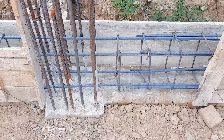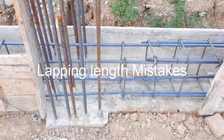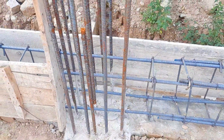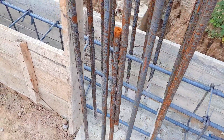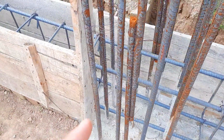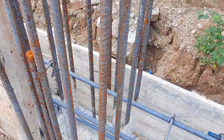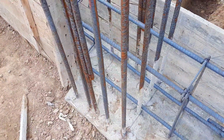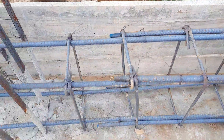Welcome back to Seven Engineers YouTube channel. Today in this short video lecture I will guide you about one of the big mistakes in the construction of plinth beams, specially for plinth beam construction. You can see this is the junction between beam and column. They provided lapping at the wrong place and the length is about 14 inches. This is one of the big mistakes in the construction of this RCC column in a four storey commercial building.